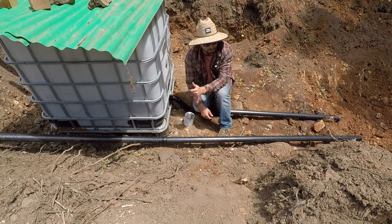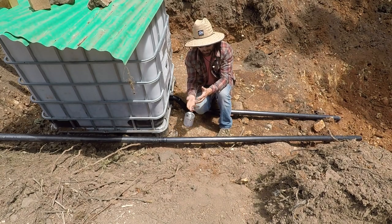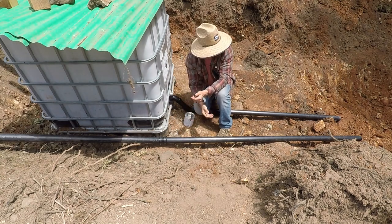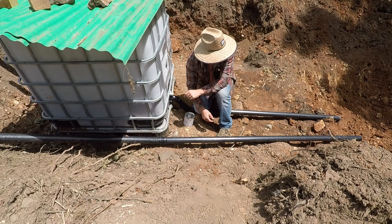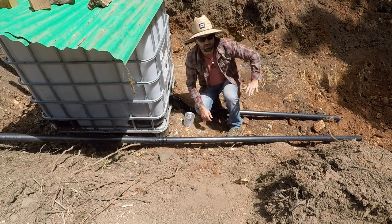And we'll be careful. We won't be using a garbage disposal, and we'll use a screen in the kitchen sink to keep food debris from coming out, to try to minimize the amount of solid material coming through the gray water. And we should have easy access to this. If there's ever a problem, we can dig down here and figure that out.